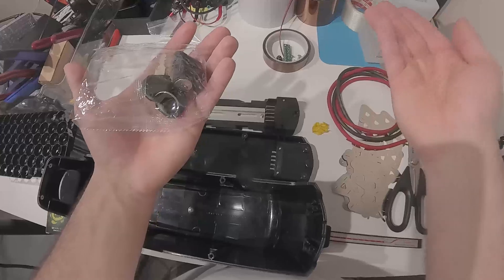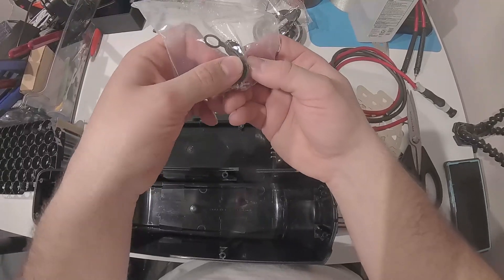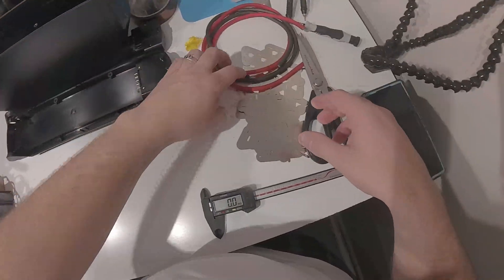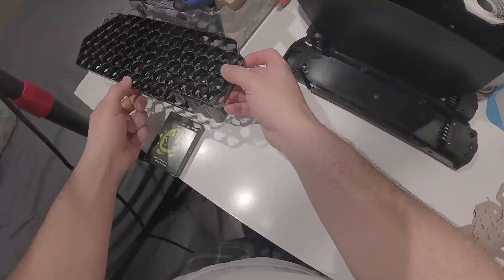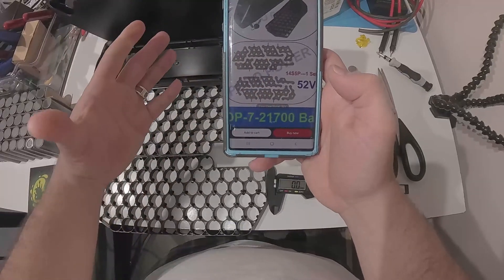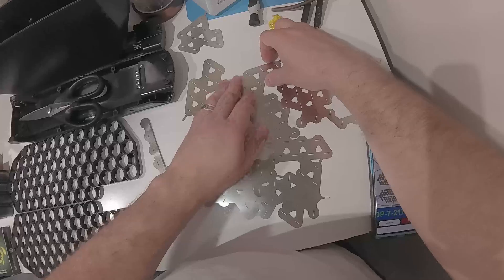This uses a DC jack charging port. The battery comes with a lock and a set of keys, a power switch, and a dust cover for the charging port. I ordered the pack with all the nickel strips. There are a lot of diagrams for the 48-volt 13s5p assortment, but I didn't find any for the 14s5p. I want to assemble it and figure out the configuration before putting all the batteries in place.